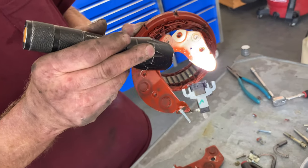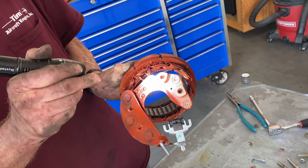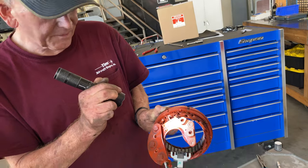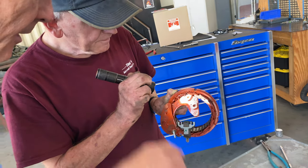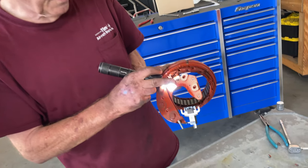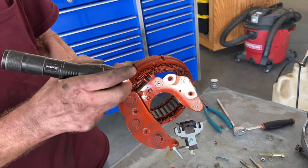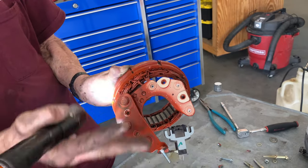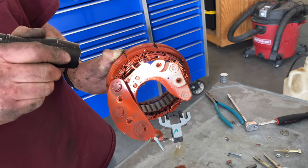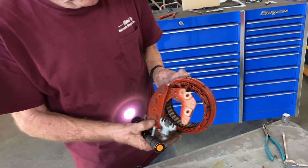See how the solder was in there? Look at that one — there's no solder. It wasn't soldered right, so it wasn't making a good connection. There was high resistance there. The ones we just tested plug right into these three holes. It's hard to see that right there, that's why it was intermittent too. When I pulled this apart, that just fell out — I didn't have to pull them hard. So that was a bad solder joint right there. A cold solder joint. That's probably what's causing the intermittent noise.